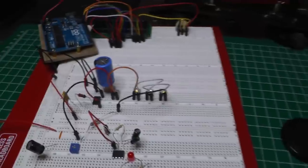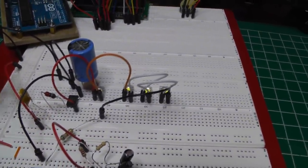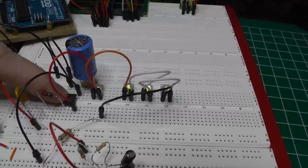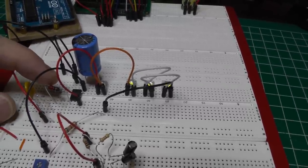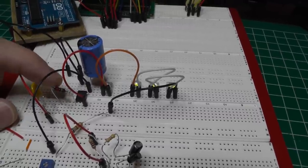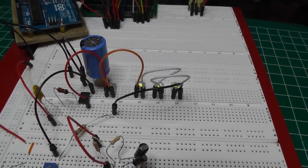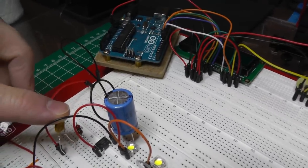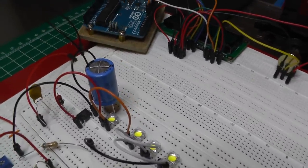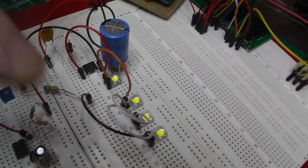I'm going to come in and go through this little chip, this bridge rectifier, to turn the AC into DC. And because I run MTH, I'm going to run through this little choke here, which will help not screw up the signal. I have one of these little poly fuse resettable fuses — it'll probably just keep the wire from burning up if it stays shorted on the track. And then I have my four LEDs.